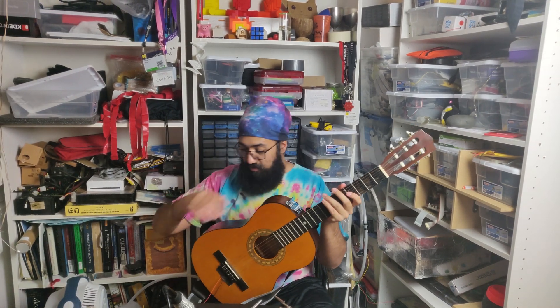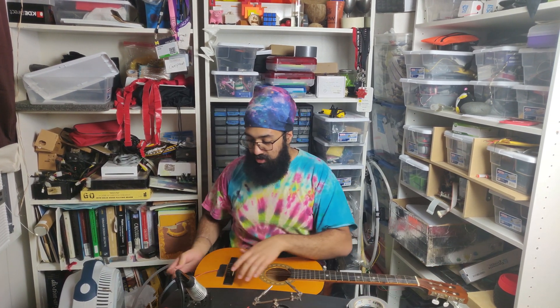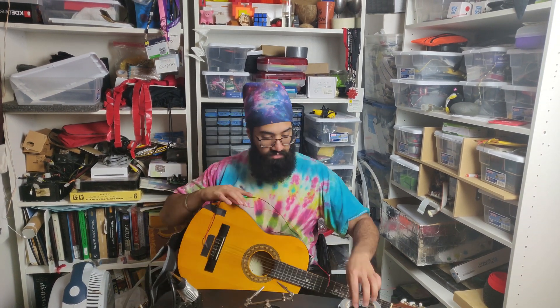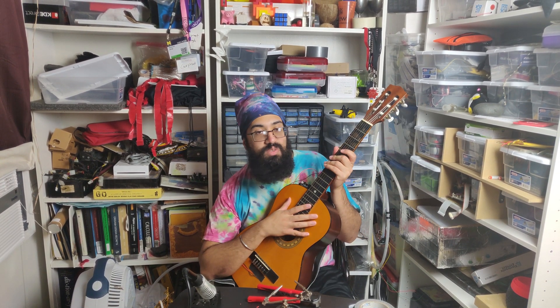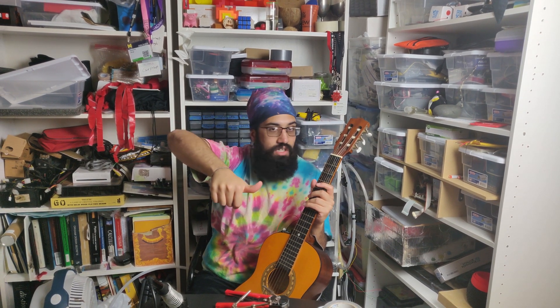Just make a little loop and pull. That looks pretty decent. Put it on here for now — kind of janky, but it doesn't really matter too much. Let's just tape these wires in place to understand where they're gonna be on the guitar. That's like half of it — 50% rounded up. Now I'm gonna use NeoPixel LEDs — the WS2812B. NeoPixel is the Adafruit version; that's kind of the standard. I'll leave an affiliate link in the description. I'm gonna put those LEDs up here on the head as I described.